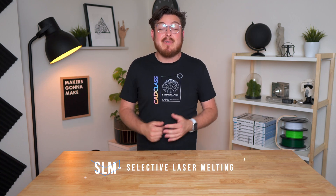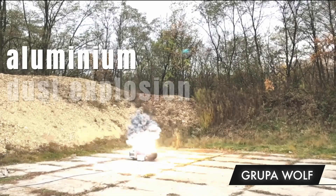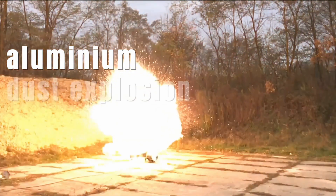Another type of powder printer is called SLM, or selective laser melting, which uses a laser beam to melt metal powder to form a solid metal part. This is a super cool use of the technology and it's being used right now to make rocket combustion chambers, wind turbines, and medical implants. Don't expect to see this on shelves any time soon though — powderized metal is incredibly flammable. These printing chambers need to be filled with an inert gas, or else when you fire a laser beam at powderized metal you're very likely to end up with a fireball.